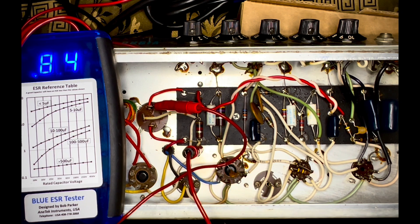So at first glance there, Bob, we're going to need to change out these cathode bypass caps. We're going to need to install three discrete capacitors, and I'll leave this cap can there for aesthetics. But with respect to the electronic assessment, your resistors actually look pretty good. None of your coupling caps are leaking at all, which is great. Even the red ones from the latter part of the silver face era — they're good caps. And then I can assess the health of the tubes once I have the power amp stable, and we'll update you then.